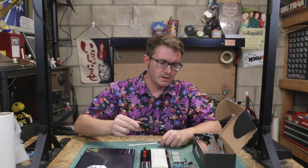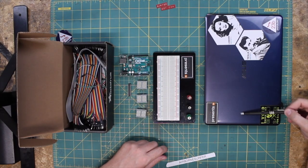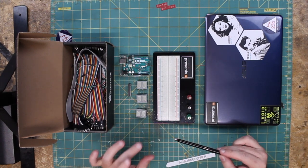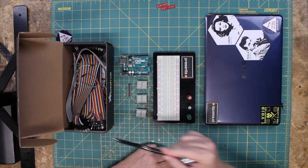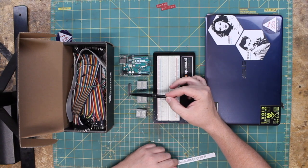Let's take a look at the parts we're going to need for this project. Of course we have our Arduino, our breadboard, and our programming laptop. We've got three of these dual 14-segment displays that I'm going to use eventually, a selection of jumper wires, and our MAX 7219 LED driver. But first, I want to make sure that my 14-segment displays work, so I'm going to set up one display and drive it with just the Arduino to verify everything.